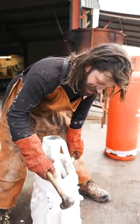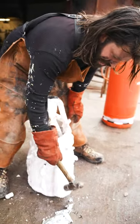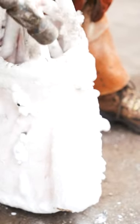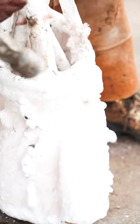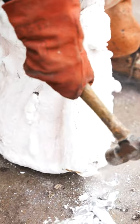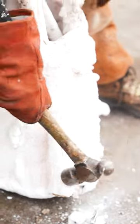So now it's slightly cooling down. You can see this crack appearing — that's where the bronze is cooling. The shell is trying to fight it and hold its form, but as the bronze cools down the shell is losing the fight and starts to crack. And now you're left with this beautiful cast inside.